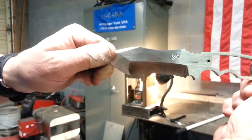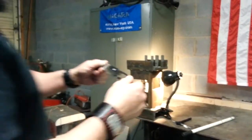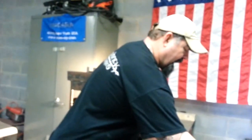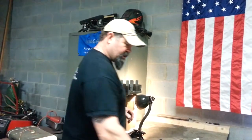The reason I use stamps to put my maker's mark in there is, just like in the gun industry, I want them to be forever. You don't see serial numbers laser engraved on a gun barrel — everything is stamped in there, it's permanent. I may still get some stuff engraved on my knives, either by etching or laser engraving, which my buddy Darren from TCT Knives does for me, but my maker's mark will always be stamped in there. It's permanent, it's forever. You can't blast it off, you can't do anything to it.